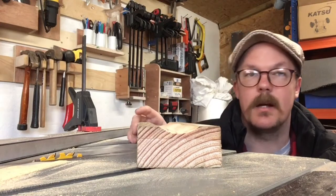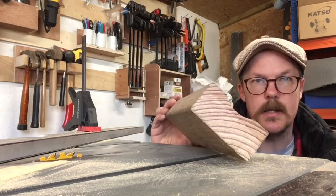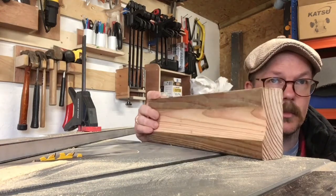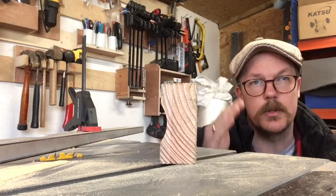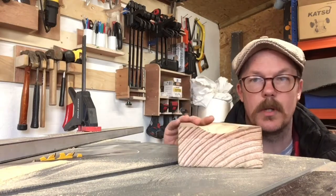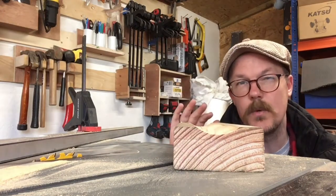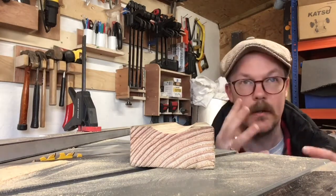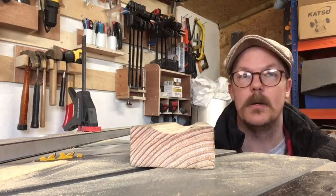Success! I think that's pretty good — a nice neat cove cut there. It didn't take too long once you get going. As long as you don't put too much of your tooth up into the workpiece you can go through relatively quickly, as long as you get a nice smooth push. If you're feeling resistance, then back off a little bit.